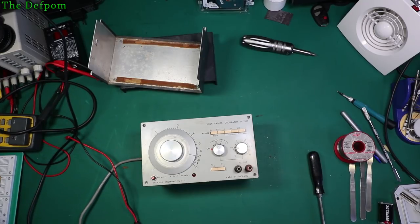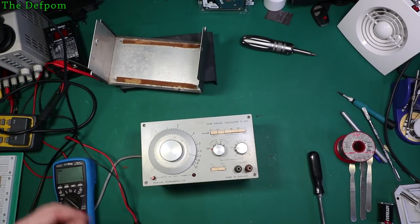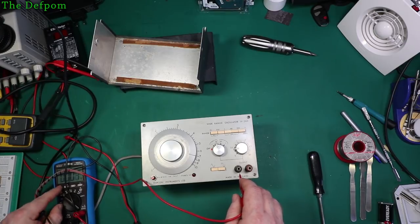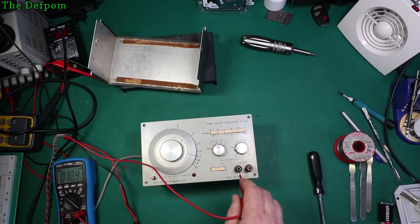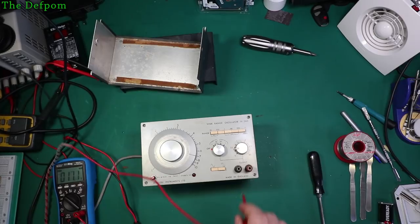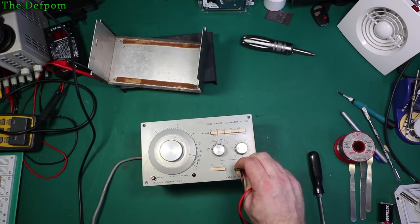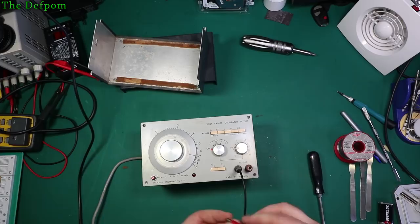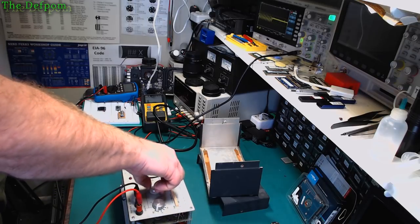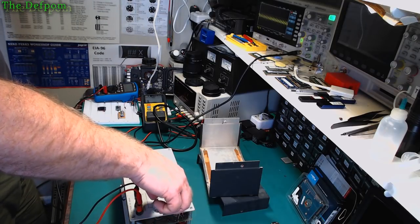It's that time when you hope the ground isn't mains-referenced too badly. To make sure it's not going to blow up my oscilloscope, I should check for a voltage differential between there and ground, just in case. Nothing on DC. AC - 70 volt difference on AC. Yeah, probably right. The output definitely seems dirty.